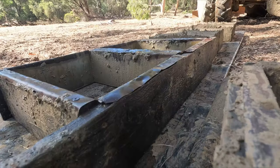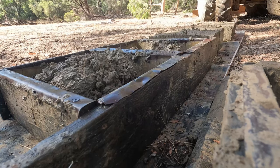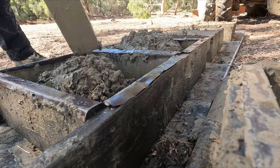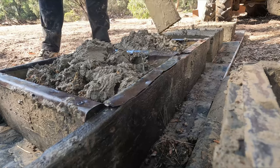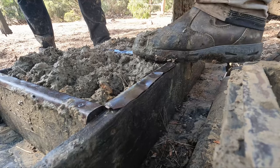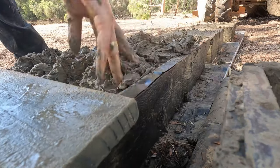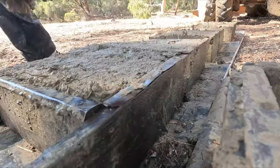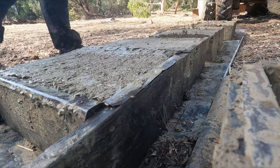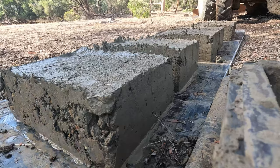So that close-up footage I mentioned — here it is. Nice mud in 2.7K at double speed. As you can see, Cam throws the mud in and we both take turns tamping it down because we want to make sure the mud gets into the corners so we don't have super wonky bricks. We don't want to tamp down too much either, otherwise the mud leaks up out of the bottom and the mould lifts — you get a lip, and then it's all different shapes. Then we try and level it out as much as possible and flatten it using the modulator, to get a nice smooth top because those are the sides that are going to contact the others. Then we lift our mould and realize there's some dry mixture in the corner — but that's the perils of working with organics.